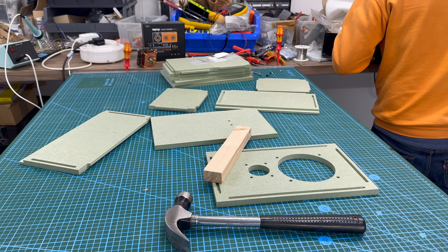The M4s go on the tweeter section - the small holes. We only need four; we're only doing one cabinet. Just don't bother putting all of them in at once, because when you bang it they'll pop out. Hold it on the side like that, nice and flat, and then bang. See, that's in - pretty solid. Just to illustrate, we'll put the screw in. So these are the screws we use - it effectively goes in like that, and once it's tightened, that is very, very strong. Much better than just using wood screws.